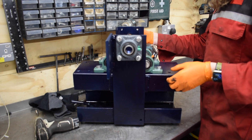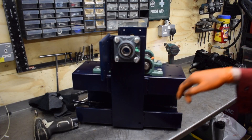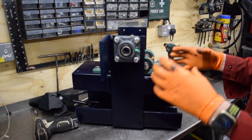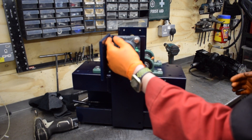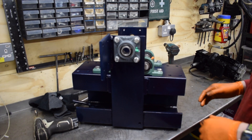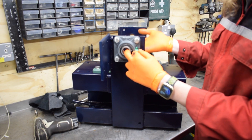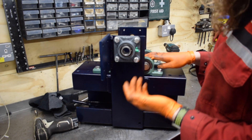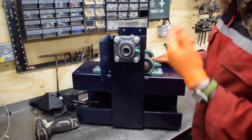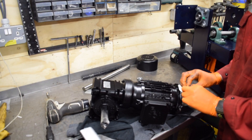For these ones I'm not tightening them all the way down — once the shaft and motor go in, it all needs putting together and tightening up at the same time, otherwise the motor can pull very slightly one way or the other. If you leave it slightly loose it doesn't pinch. You don't want any unnecessary load on components — the bearings obviously take an actual radial load, but avoiding a constant unnecessary load helps, and it also means you can take the shaft out without it being pinched.